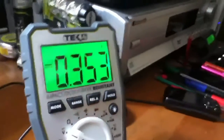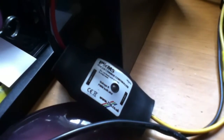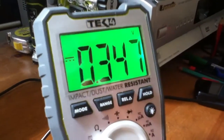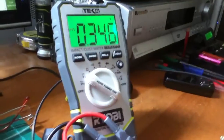4.5 amps isn't quite what I put through it in my application, but about 350 millivolts. The reason I'm doing this is because the charge controller that I make — my PWM5 — has this Schottky diode there, under a piece of yellow heat shrink. And I was just interested in how much loss there was in that diode. That diode is really necessary because it provides all the short circuit protection. And of course, it's a lot better than a silicon diode which would be at about 0.6 volts. This is now settled at about 0.35 of a volt, 350 millivolts, at 4.6 amps with the entire array of light bulbs switched on.